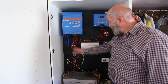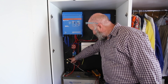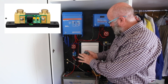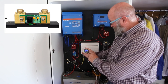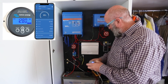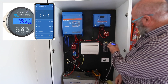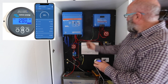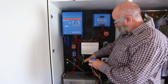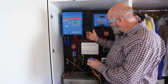On the negative side, coming up, there's this black thing here which is the voltage meter. At the moment it's reading 13.9 volts. It'll eventually go in the door there. We're on absorption right now, so not everything's going into the battery - the battery doesn't need as much as the solar is providing. So I've got excess.